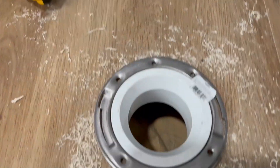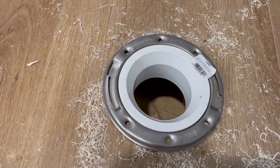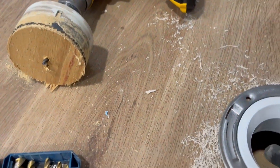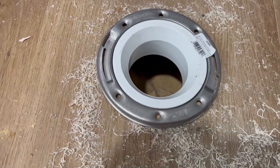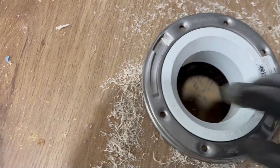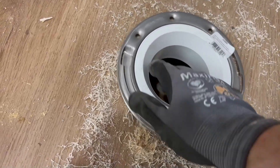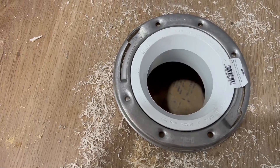For the spacing from the wall, the minimum is 12 inches from the back of the wall. Since I've got plenty of room in this bathroom I'm doing 14 inches just to give me a little bit more space. I used a four and a quarter inch hole saw, which fits pretty snugly around here — that's probably what I would advise using. As you can see there's insulation down here and it's strapped up with some chicken wire in the crawl space so I need to pull that out. I can get a piece of three inch pipe glued onto this and then mounted, then go down in the crawl space, connect an elbow into it, and then connect it into the sewer main.